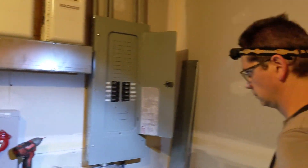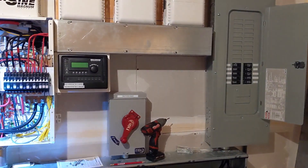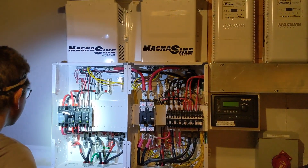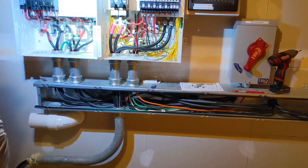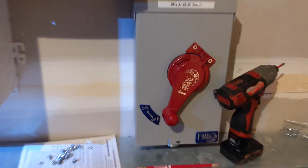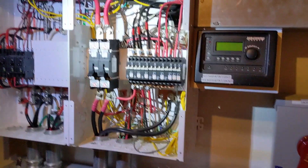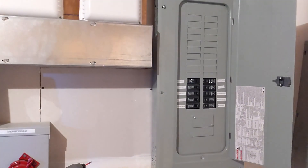We're gonna rip and tear — not every day you tear off a perfectly good system. We do have some problems with this inverter but Johnny is gonna repair that or get the parts and fix it. This is a retrofit, so we're going to maintain some things like our DC side for freezers and air conditioners, and we just need to work through putting a bypass in, installing the inverter, getting rid of the charge controllers, and rewiring the solar array correctly for the MPPT channels.